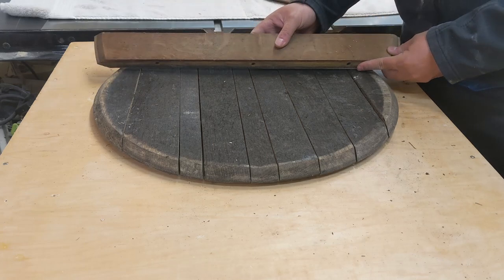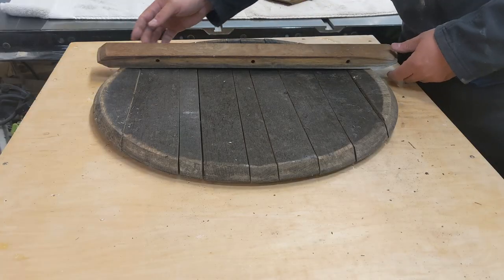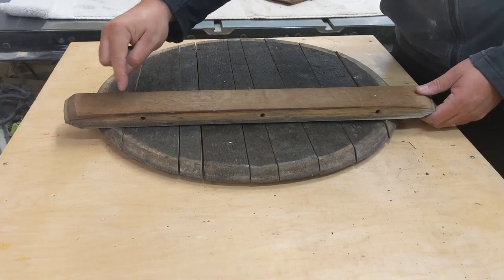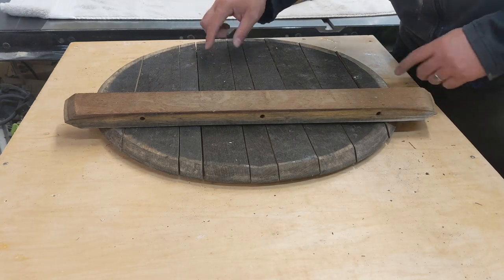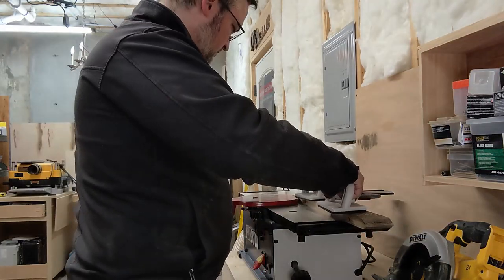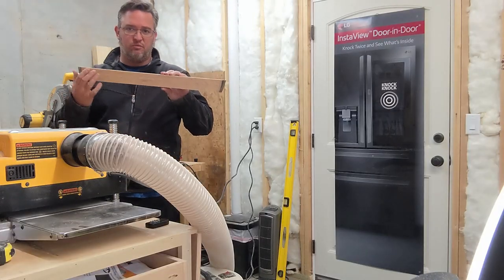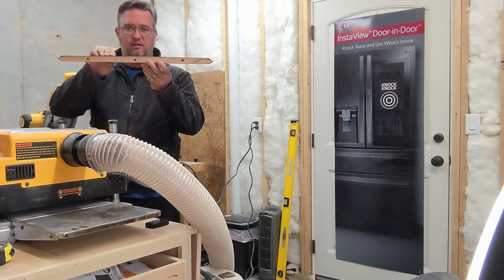What I'm going to do is take a scrap piece of another barrel top and rip it into about two inch strips. I'll put one strip at the top as a french cleat to hang this on the wall and one strip at the bottom. Each strip will have screws going into each barrel top piece to hold everything together without wood glue. I'll run these through my jointer on one side, then through my planer to make sure they're nice and flat on both sides.